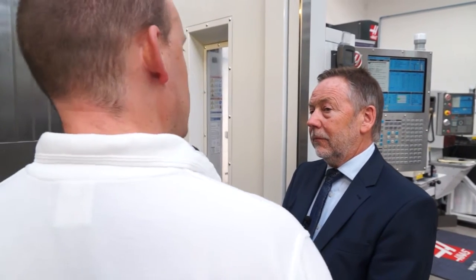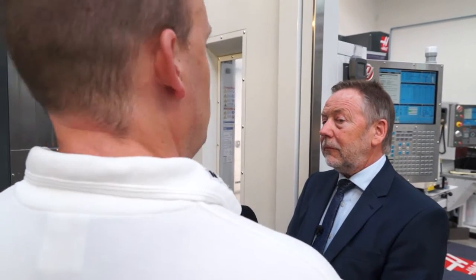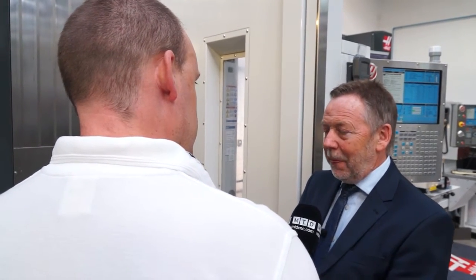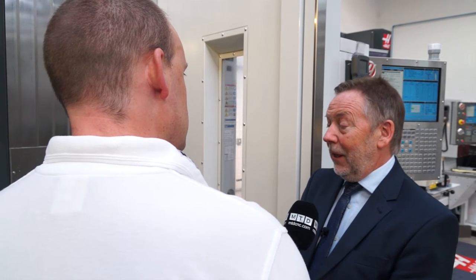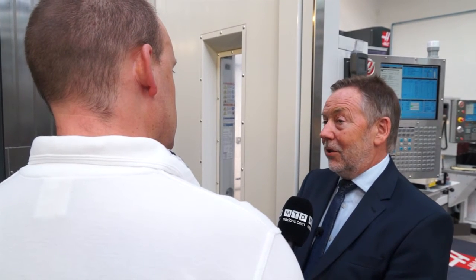So although this is a new model, it's using the componentry and technology already incorporated into your other machine tools. What about the software and the control — that has to be new and developed? The software is where it's a complete departure. It uses the principles developed in the trunnion system, but now has two new, quite unique features: one is called TCPC — Tool Centre Point Control — and the other is called Dynamic Work Offset Shifting.